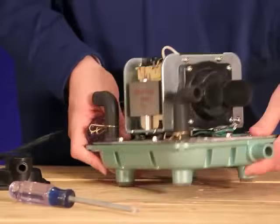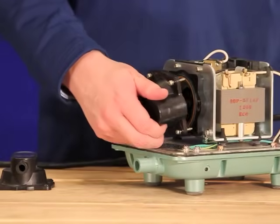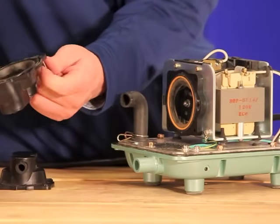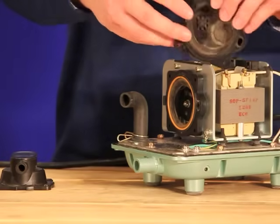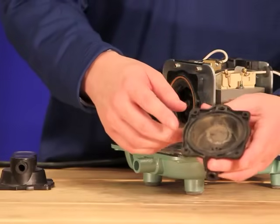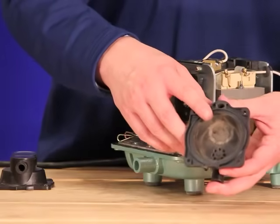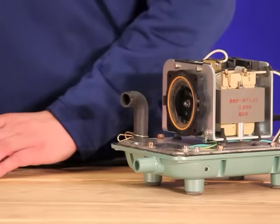We're going to turn it and do the same thing on the other side — pop that head off. These four screws again you are going to want to save all of these because you will reuse them. One thing to note: we do sell the diaphragms only, which is just this piece. But we always recommend you buy the whole kit, because there are air valves — you can see one here and the other is reversed inside this piece — that go bad. So buy the whole kit; it is worth the extra money to buy a kit that has the back piece included. And that is what we are going to install here today.